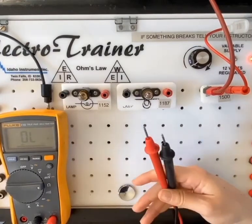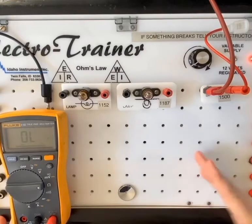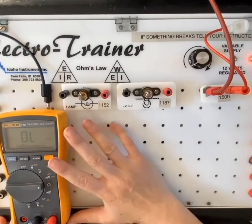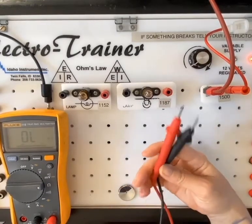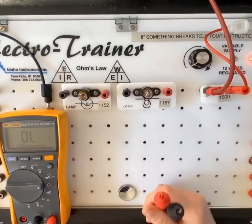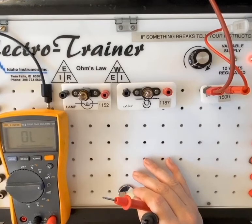We could ohm test our fuse, our switch — there's lots of things we could ohm test. But ohm tests are the equivalent of sending a motorcycle down the freeway just to see if there's traffic — it's simply a trickle. It's not a very good way of testing because if there is any traffic a motorcycle can simply split lanes. We're only sending out a little trickle, which is why voltage testing works so much better. If we had a restriction, this wouldn't really see it because it's sending a very small amount of current. But essentially that's how we do an ohm test on really anything — questions in the comments, let me know what you think.